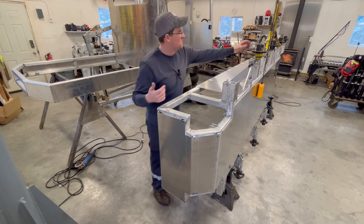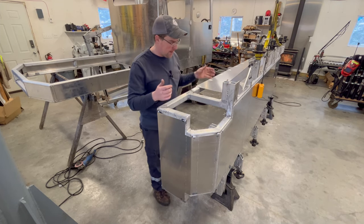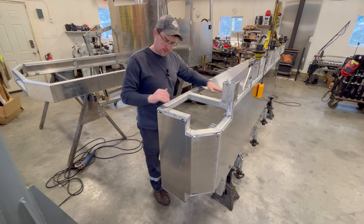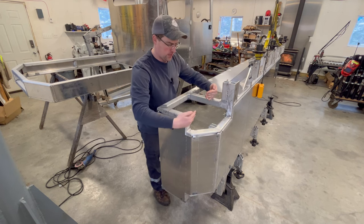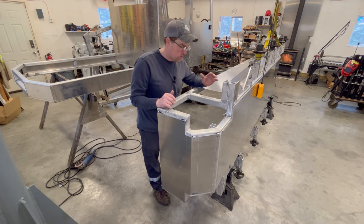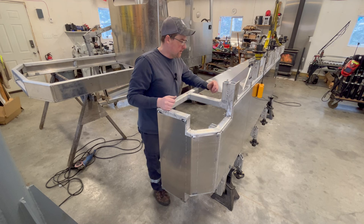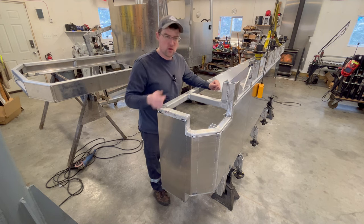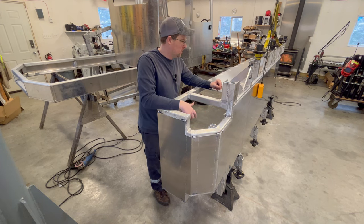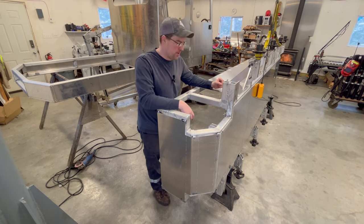All right, we just got the bottom sides of all these gussets welded, but I guess before I call it complete one side, let's finish closing in this back here. We need to notch it down, seam weld it all in. So let's make up this part, weld that in, and then I think I'm gonna call that quits for this video. I'll go ahead and repeat the other side, which is cookie cutter. So let's get some measurements, cut up some material, and do a little bending and tigging.